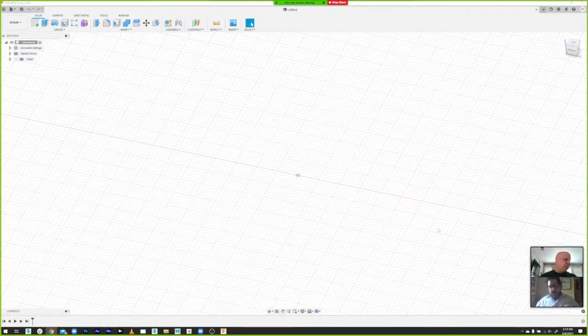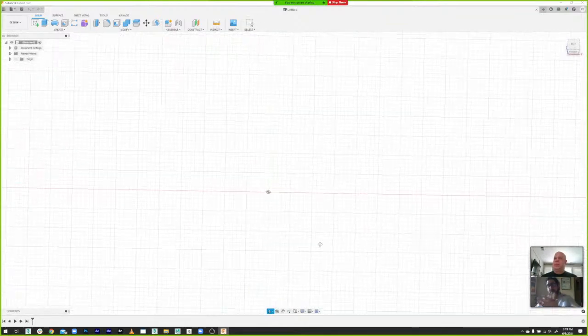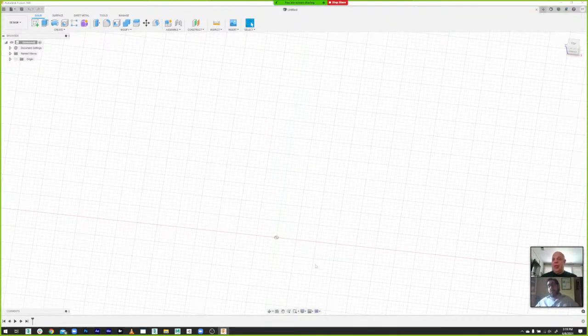Especially when setting up your tool paths, accurate measurement is very important. Sometimes I've gotten 0.74 on one side and 0.72 on the other. You can average it, but you have to make sure your offsets go through the bottom of the board enough into your spoil board to actually cut it free. I've done a terrible job surfacing my spoil board, so sometimes the front of a piece cuts all the way through but the back doesn't, and then I have to rerun the program or trim it with an X-Acto knife.